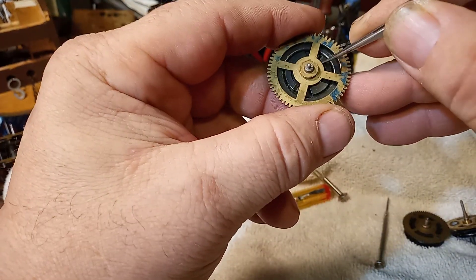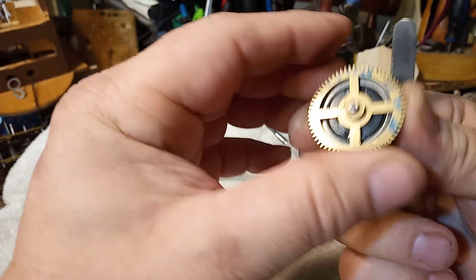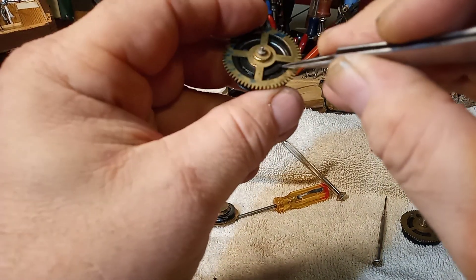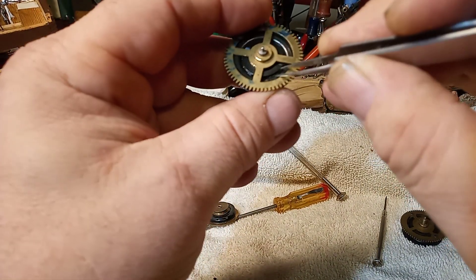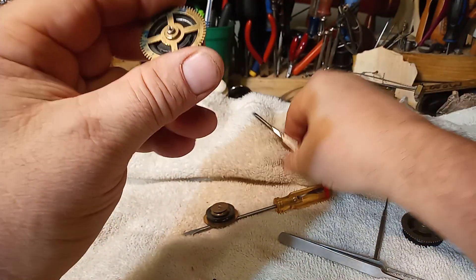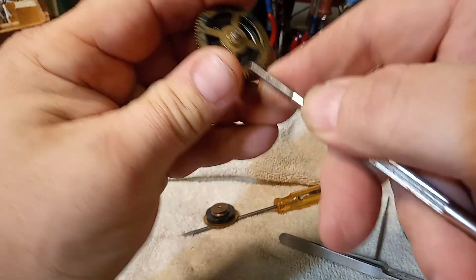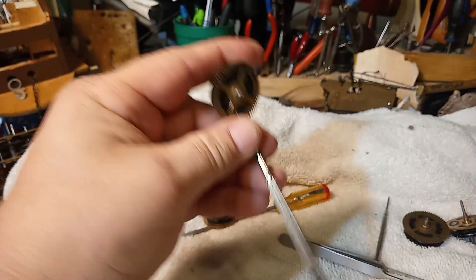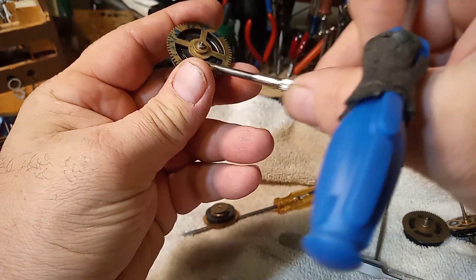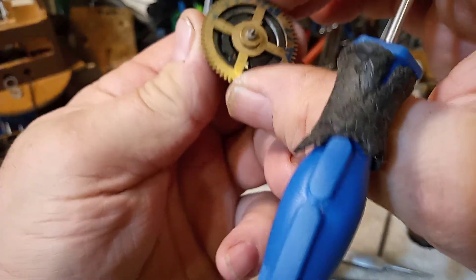You have two different pieces of metal that push down to ratchet it. A lot of times this little tab right here is broken, but you could still use this assembly — all you have to do is put a screwdriver underneath it, then take another screwdriver and push it down so the remaining piece of metal will act as your stop for the click.